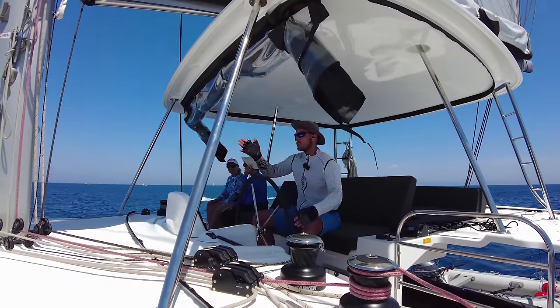Okay, I close the stopper of the black line. Tension the sail. Keep enough slight pressure on this black line. Take wind angle. This is an apparent wind angle of 45, still under wind autopilot. So now we're good to turn the engines off. Yeah. We are underway.